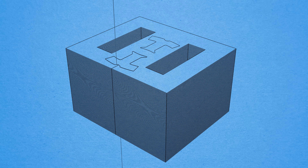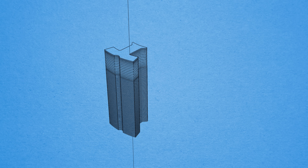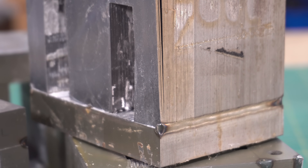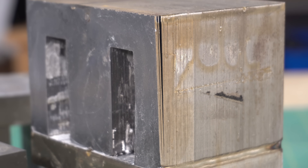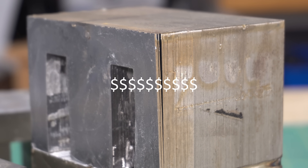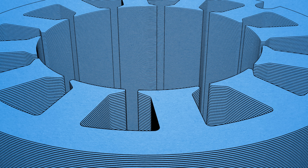I contemplated numerous methods for creating my own stator. One idea was making stator teeth out of recycled transformer cores through wire EDM cutting. However, this method poses various challenges, including the risk of laminations separating during the cutting process and the difficulty of sourcing transformer cores with consistently thick laminations, as well as finding a service willing to work with me. Another idea could have been cutting and stacking the laminations myself, but I don't have a machine capable of cutting laminations, nor do I know where to buy electrical steel for a reasonable price.